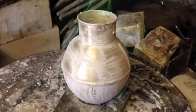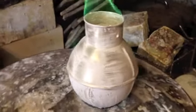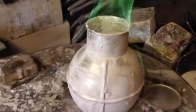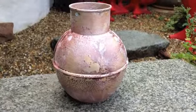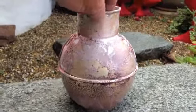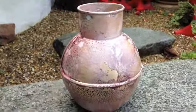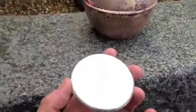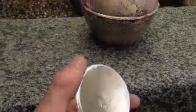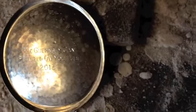I'm going to now solder the whole of the can together. Just finished soldering all the sections of the milk can together — they've all been silver soldered around the joints; hence you've still got the staining on them. The next thing I'm going to do is put the base on. That's that little piece here with the Guernsey hallmarks on.